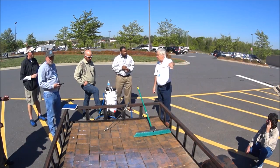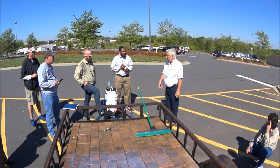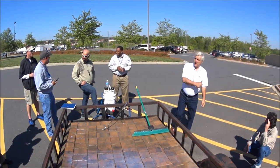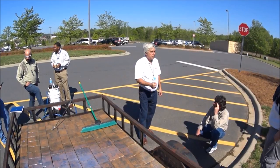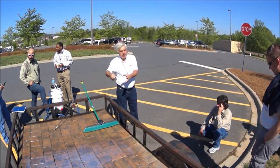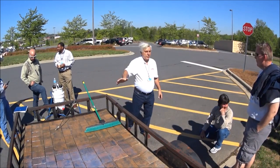Sometimes guys set up cardboard or they take off things. Right. I have overspray. I can control the sealer. I practice. That's what I was going to say. If you're going to do this and you're going to get whatever pump you use, get your painter's wrist. Get a big concrete driveway with water, and be out there. You don't want to come to the end and get a big blob of sealer there. You just want to get your wrist with your consistency.